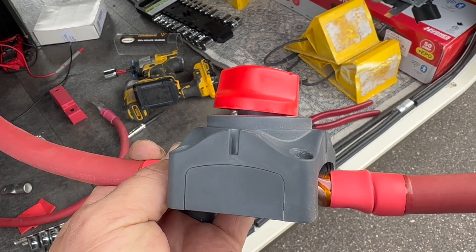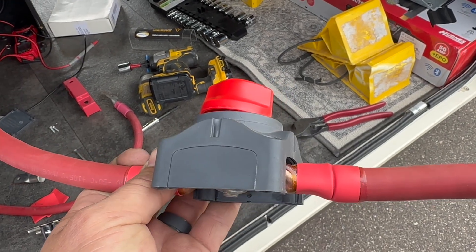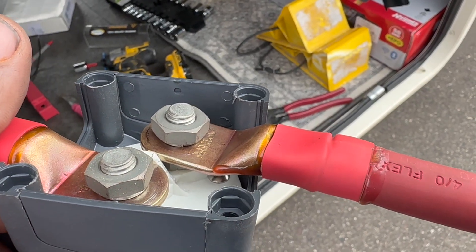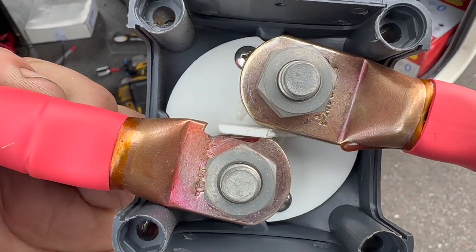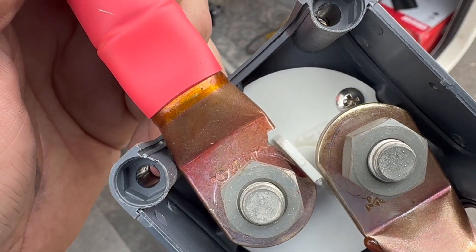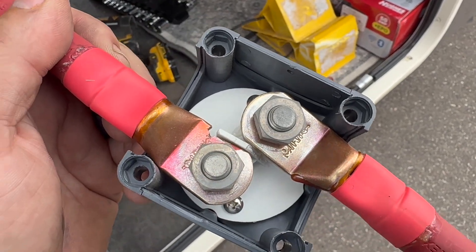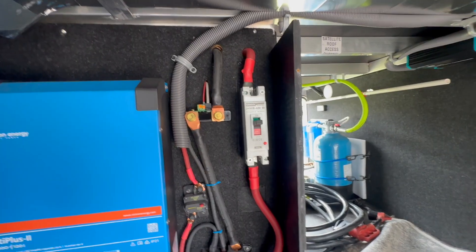You can see it's not square on there anymore — just a lot of evidence of heat. I can't stress enough: if you see glue squeezing out of your heat shrink, you've got a problem. That's a definite early warning sign. Also, if you're having to notch or modify your lugs to fit into your switches or breakers, that's a problem.